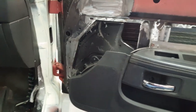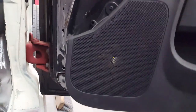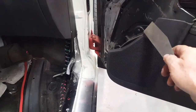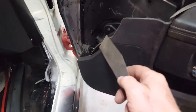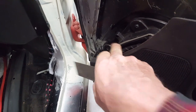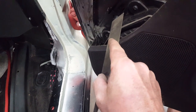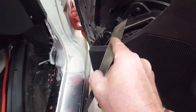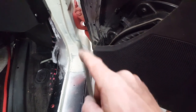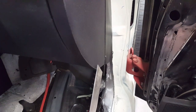To illustrate what I'm talking about, you can see with the door panel in place that the speaker rim is just barely peeking up above the door panel, and this is fit so that this clears the bottom of the dashboard. So with this set back a little bit further, it allows me, when I make this top closure here, to just go up on a slight angle instead of straight in, because this right now ends up right about here.